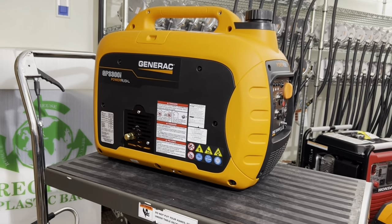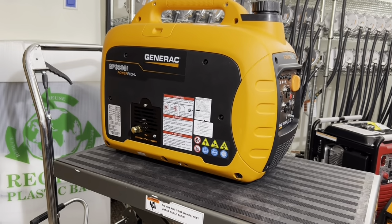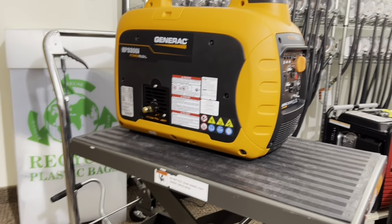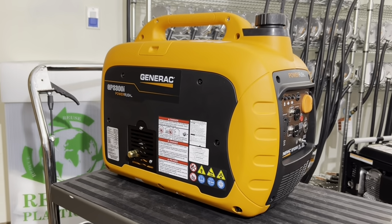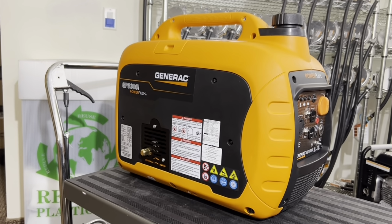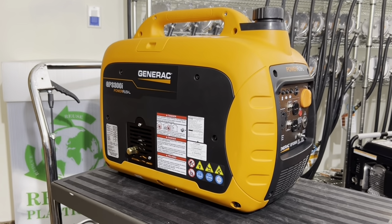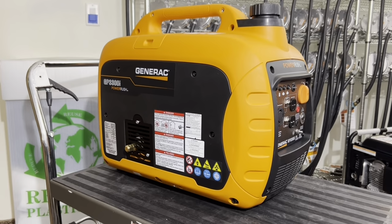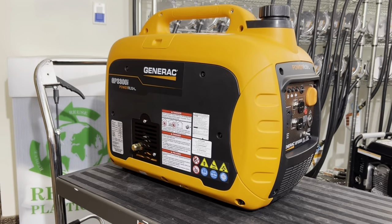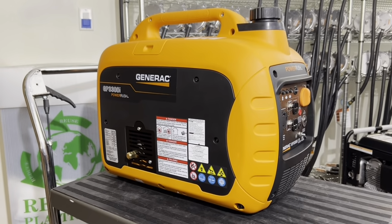Okay. Number 8. Never run the generator in the rain. It is not waterproof. Especially, don't leave the generator in the hot sun. Treat the generator as you would treat yourself. There's not any single waterproof electrical connection in this generator. If water gets in it, you'll short something out. When you short something out, such as electrical components, the ignition system will go out, and you will ruin your generator. Okay. Also, don't leave it out in the hot sun.